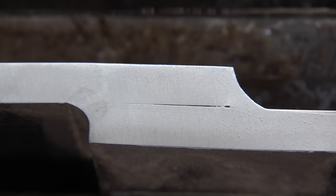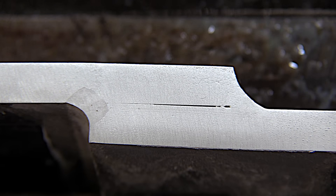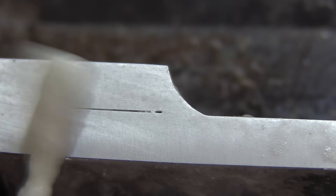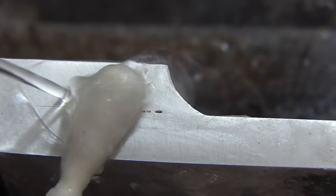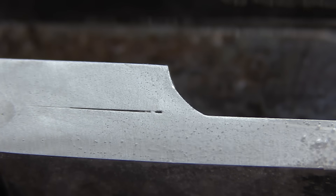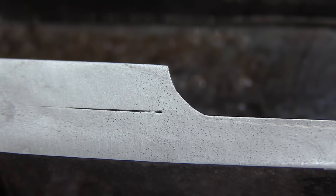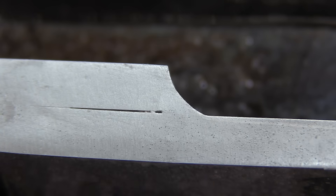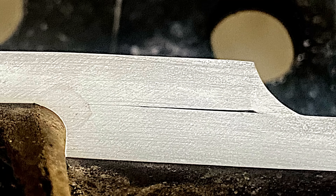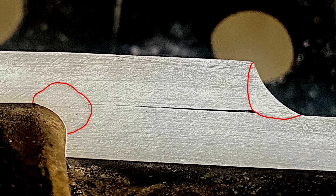The results are not that surprising to me. That laser weld is an almost picture-perfect weld nugget, punched in there with great penetration. The TIG weld is in there, but barely — really shallow throat because I was trying not to fill up the throat or chew off the corner. Side by side, I'll sketch a line around the fusion line to help you see it: laser on the left, TIG on the right.